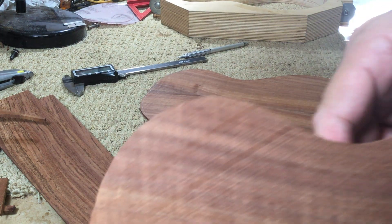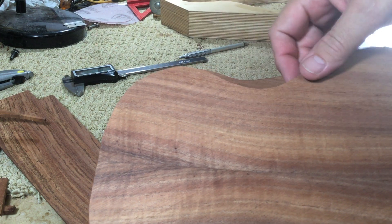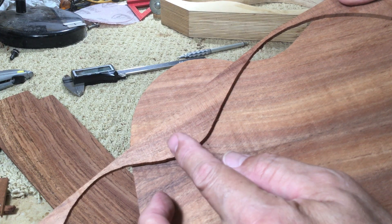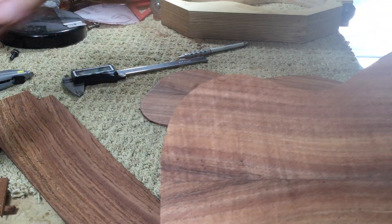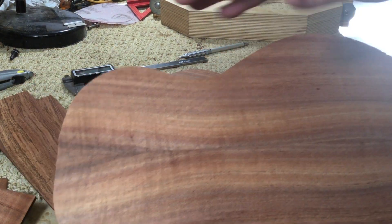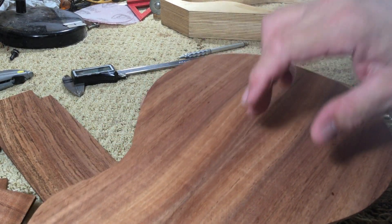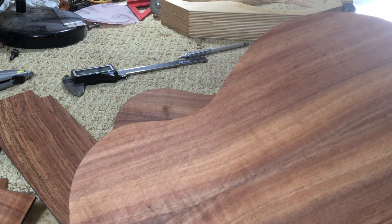You can see the crosshatch pattern right there — we're sending it through at an angle, not straight just yet. For reference, here are the milling lines from the saw, so obviously we've got to take out all the saw lines. This is actually a nice cut. You can see the crosshatch pattern in 80 grit; we're going to go to 120 and do the same thing. Now, this is actually fairly thick for a ukulele at about 100 thousandths.